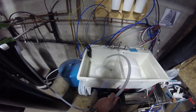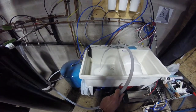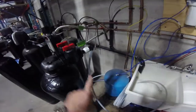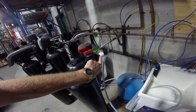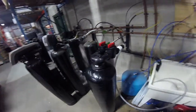Let it run while you're putting your tools away, and once it runs to a clear state you know the carbon is flushed. On this particular unit we've put on a five gallon per minute flow restrictor — we're just testing that to see if it's needed. I think it'll be just as good without the five gallon per minute flow restrictor.